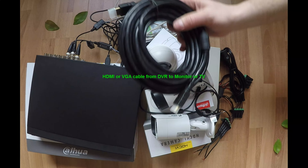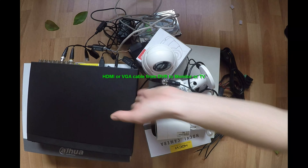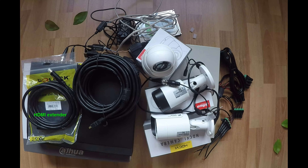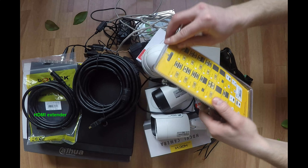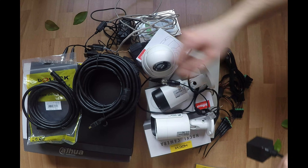Using an HDMI cable, you can connect the DVR to a monitor. You can use a 10-meter cable and it will work. You can also extend the HDMI cable using some female HDMI extenders. If you want to watch the live preview on two monitors, you can add an HDMI splitter at the rear HDMI port of the DVR.